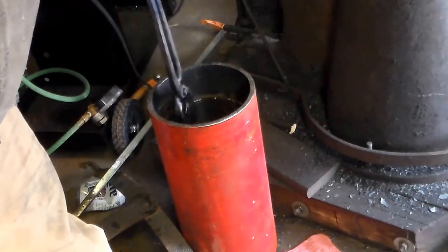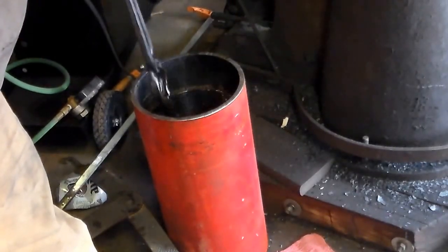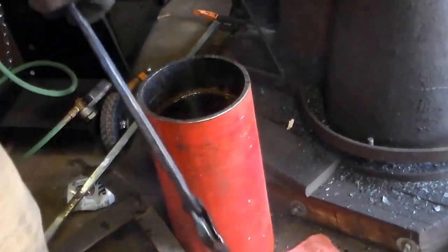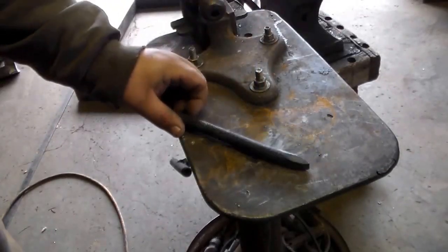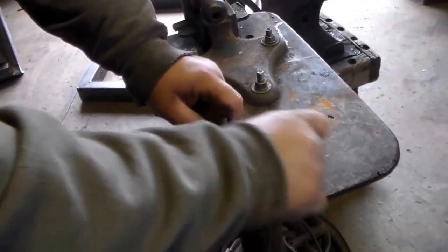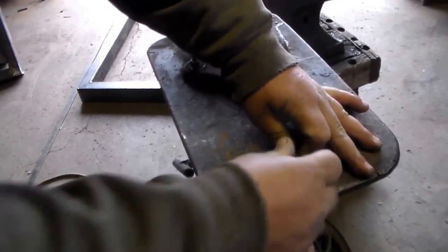This is why you wear gloves when you do this. Straight in, all the way around — use the oil. If you pull it out now it's going to flash — very exciting. What you've done by cooling it from the non-magnetic temperature is made everything inside cinch up so it's very brittle, very hard but very brittle. It's below critical now. Our chisel is cool enough to touch. I took it and wire-brushed the oil off. This is where emery cloth comes out — we've got to get this shiny because when we're tempering it we need to be able to watch the colors run.